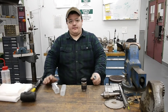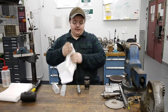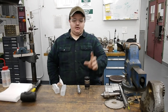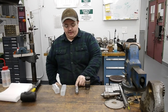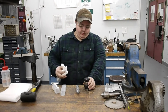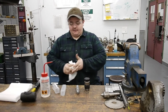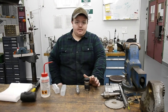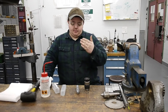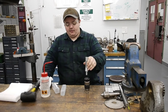So let's get started. We're going to take the body of the drill chuck and thoroughly clean all of the surfaces that are mating for the taper. The Jacobs 33 taper is a pretty common size — you can buy these arbors on McMaster or MSC, or used ones off eBay. We're going to take a cleaning agent — I'm using acetone, which works great as a degreaser — because you really don't want any grease, grime, or chips stuck in the tapers. If there's any small buildup on one side, when the tapers go to meet it'll cock the arbor at a specific angle and prevent it from running perfectly concentric with the drill chuck.